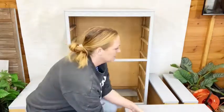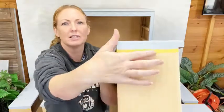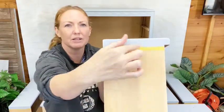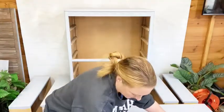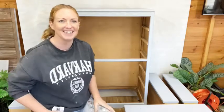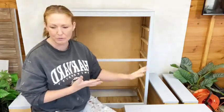I've done my normal prep and I've taped off my drawers. I cut round so when I reveal it, it shows off the lovely dovetail joints. We have primed two coats everywhere - a really, really nice smooth finish. It's a really good primer; it gives a lovely smooth finish.